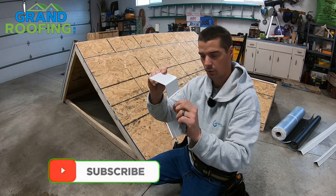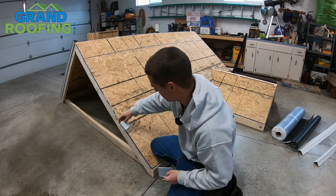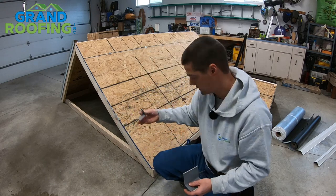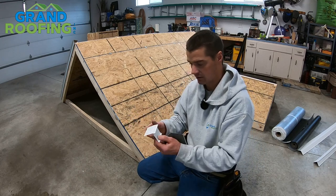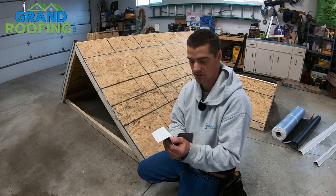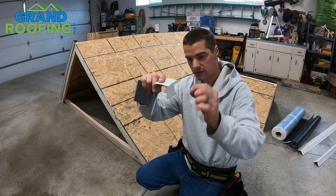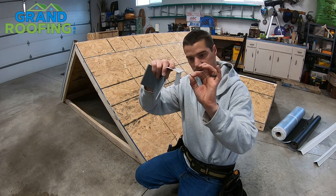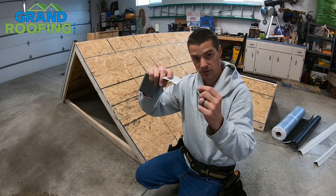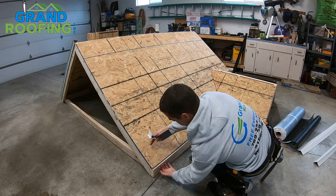It's got a little hem down here for the water runoff. This is drip edge — goes on the gable ends. A lot of guys around here use drip edge on the bottom. It's not a problem, but there is a downside. This lip that comes out — when you've got a gutter trying to catch water, some of these actually hang down further, and then you want to hang your shingles down past that, so you're reducing the effectiveness of your gutter catching the rainwater.